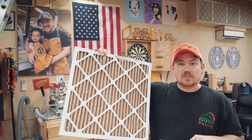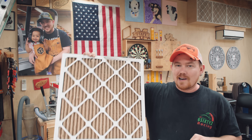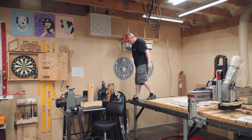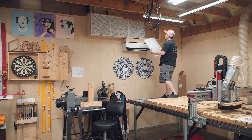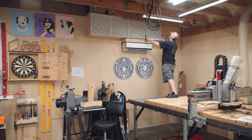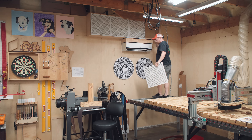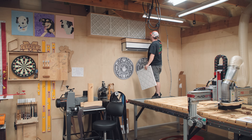This air cleaner cart does need to move a lot of air because I want it to filter as much air as possible, whereas the mini splits are just trying to change the temperature. So this is three quarter inch plywood on this box and I'm halfway through the plywood sticking off, so I'm going to go three eighths of an inch too large on this end. I'm going to have to compress one of these filters.